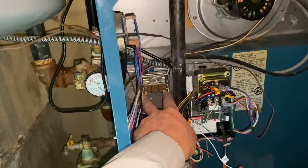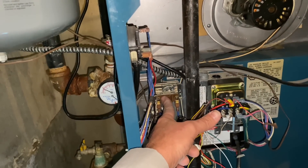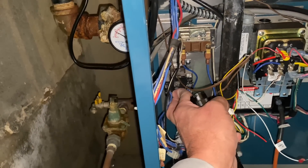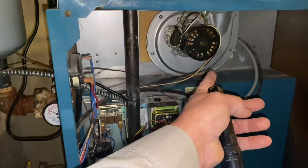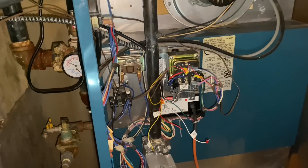Let's see if the problem goes away. We've done the right troubleshooting steps: we took voltage readings from our intermittent ignition control module, we bypassed the switching relay and wire, we monitored voltage going to the control and saw how it jumped out, we visually checked our terminals on our high limit Aquastat, our rollout switch, and made sure our relay for our blower is intact. The only thing we did not check is the pressure switch going to our inducer motor. We have ignition — first stage is open, there is second stage, so we're fully open now.